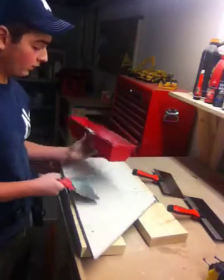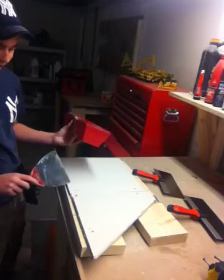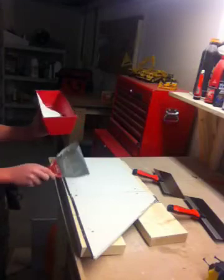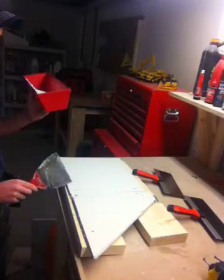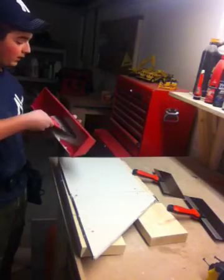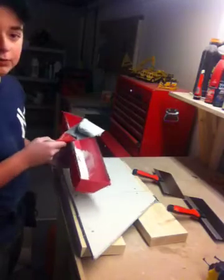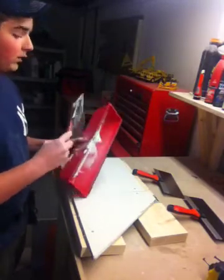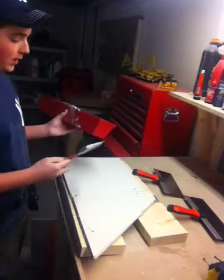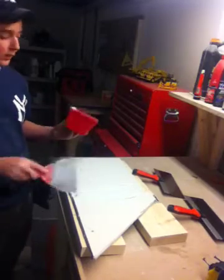Now, when you're doing a recess joint, the recess starts, say, about 2 inches off the piece of the drywall. So you have about 4 inches of recess joint. You can get on your 6-inch knife this much mud, but you really don't need this much. So I like to cut that in half using my mud pan, which has a blade on it. So you just cut in half, and you just apply a thin layer of mud.